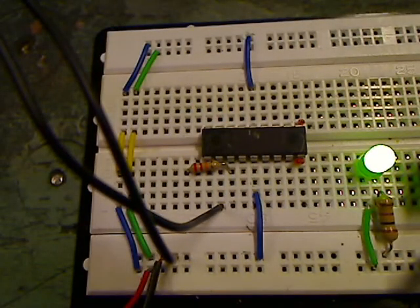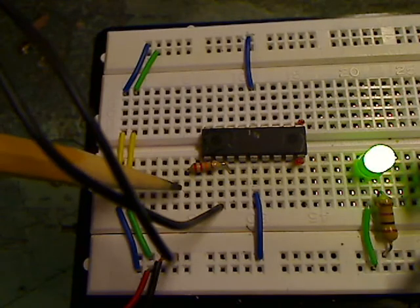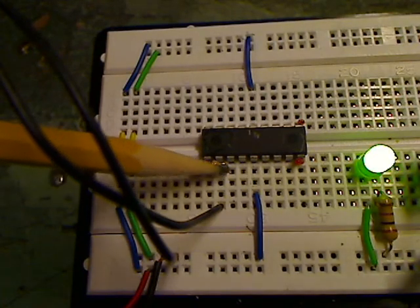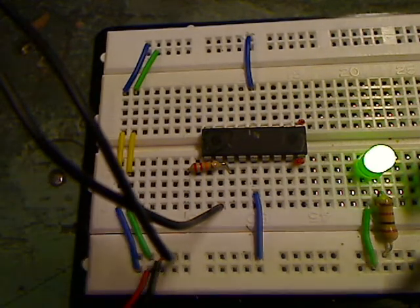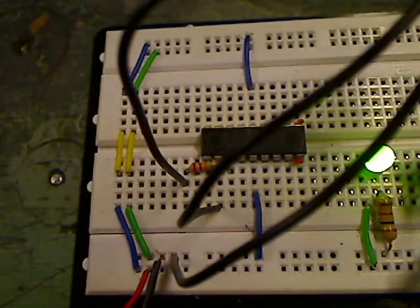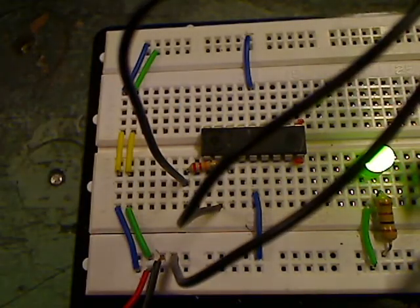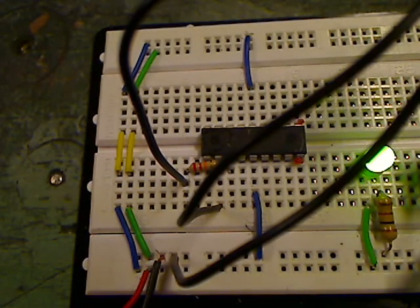Because it's a breadboard, I've jumped the circuit all the way across this row over here. So I can take that right here and put it here. But there's one more resistor involved, and that resistor, according to the schematic, ties this all to ground — and that's a 10K resistor. I have one right here.